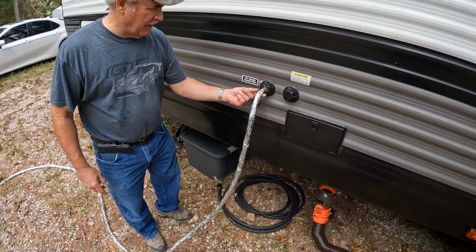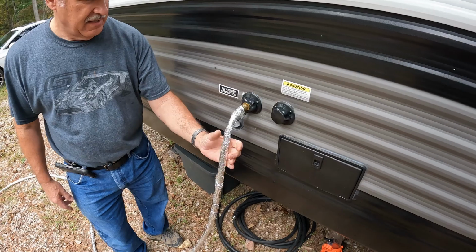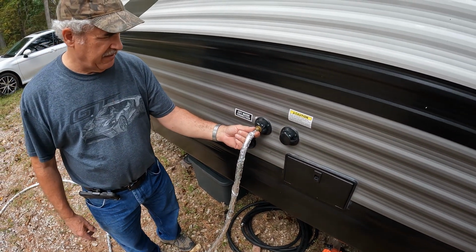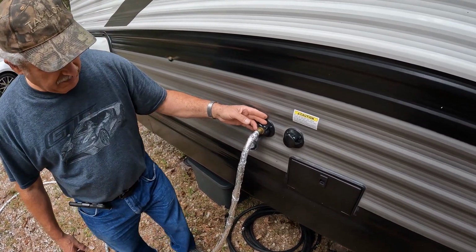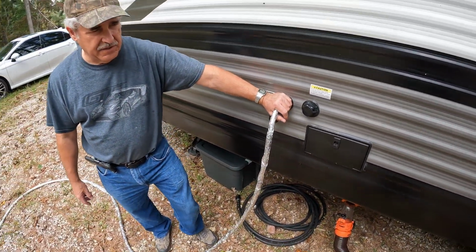Like I said, the directions say to wrap it with aluminum before you put the heat tape on. And then I'll just do electric tape right here to keep it separate. Go up here, and like I said, whatever extra I have, I'm going to come down and wrap it around the valve there so that doesn't freeze.